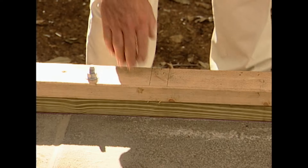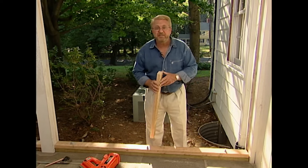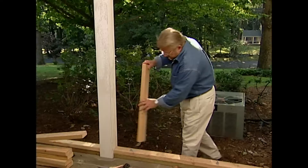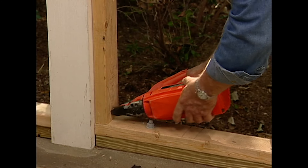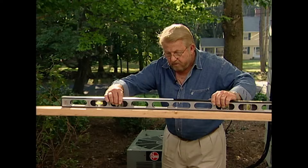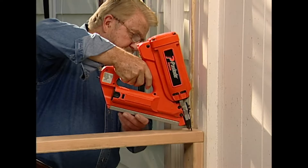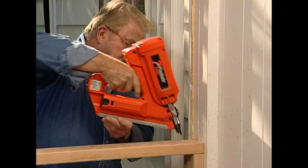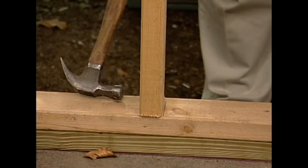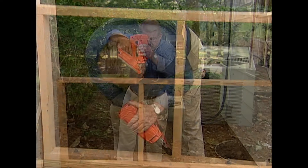My double base plate is in, securely fastened to the deck. Now what I'm going to do is build a short wall here, complete with a top plate and studs about every 16 inches. The end studs are nailed to the posts. Then the top plate or sill is set in place. I check for level, then nail it down. Next, I install studs every 16 inches or so, making sure they're plumb or vertical, then end nail at the top and toenail at the bottom.